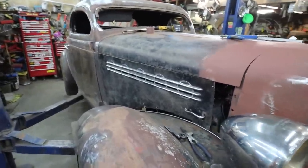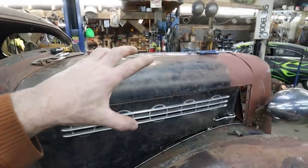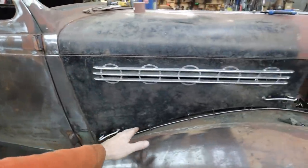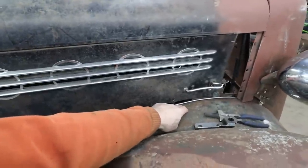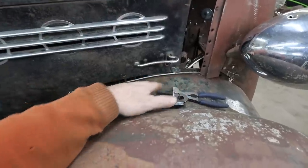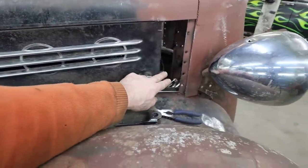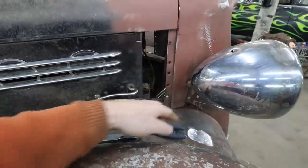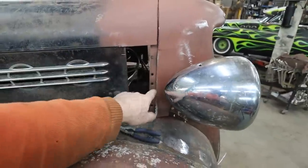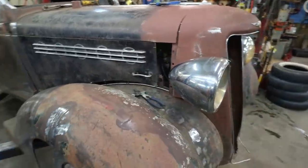All right. Anyways, now I think what I'm going to do is pull the hood off, split the two sides. Well, maybe I don't have to, I can maybe work with the whole hood together. We'll roughly sheet metal this, and I know I have this marked goofy, and I think I'm going to end up changing this front part yet, but I might zap this back. We'll cut this off, move it ahead to line up with the front of this, and tack something in there just to try to get a good shape, put it back together and see if we made stuff right.